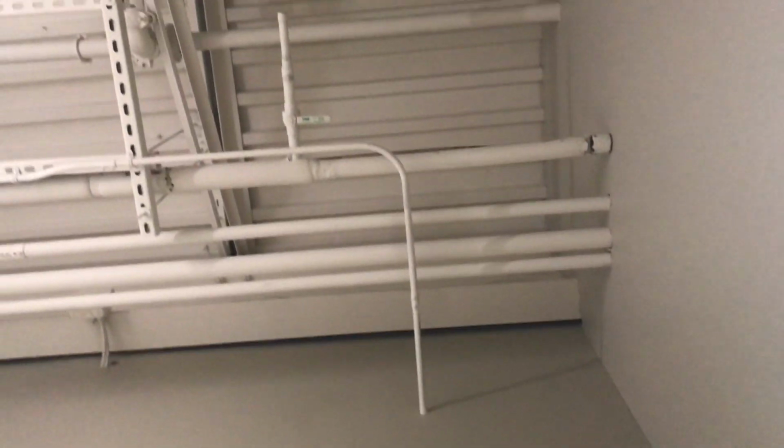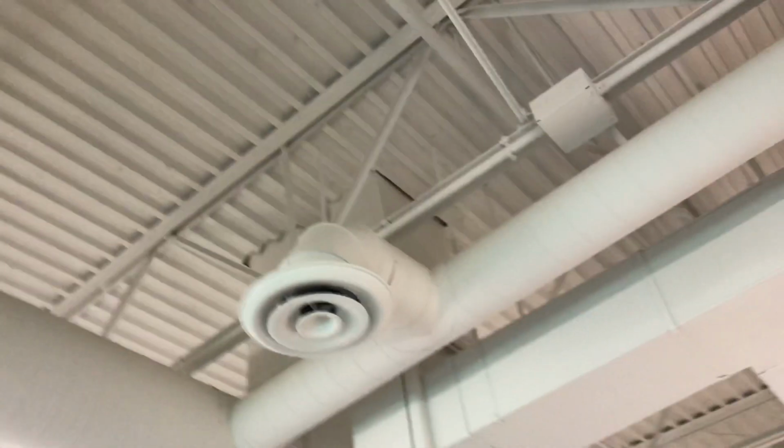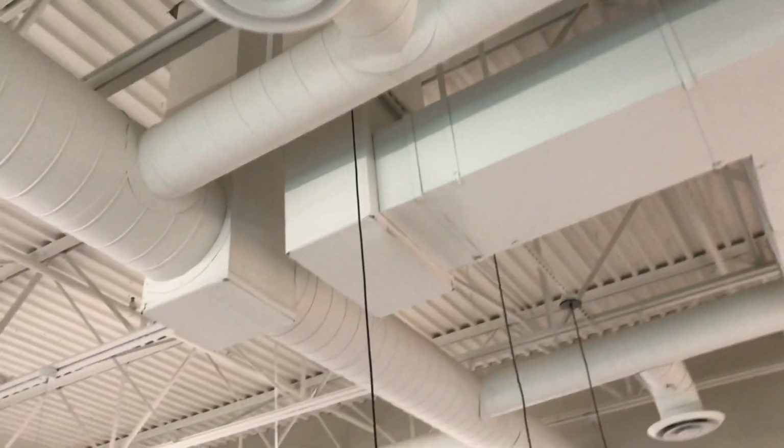So we got the control module mounted here, the QT100, and went up into the ceiling and all the way out into this exposed ceiling area. Took it around here, all the way around to the first speaker. We used the universal bracket to mount with the beam clamp and a 1/4 threaded stud.